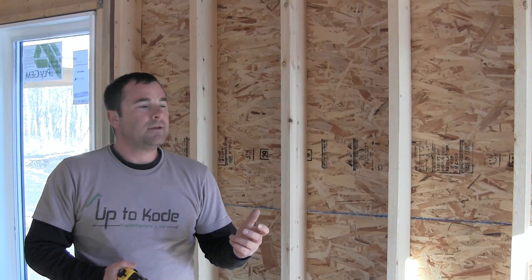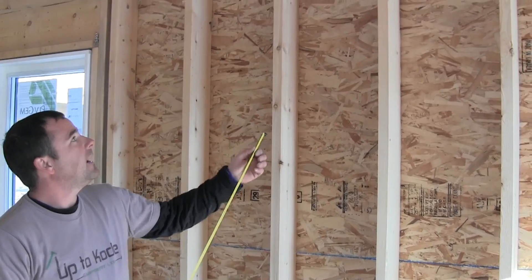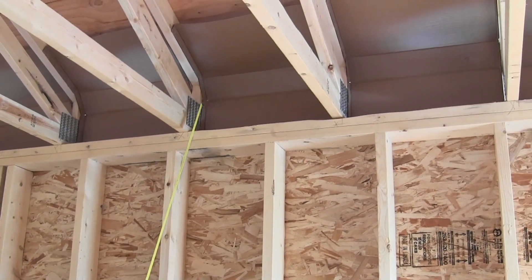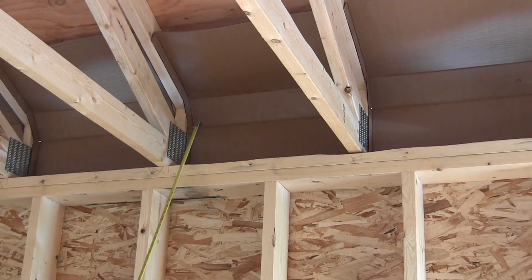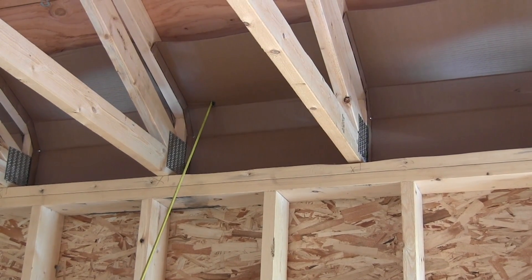Here's a high efficiency tip. We're going to talk about roof trusses. Typically when you order your trusses, you have about a four inch heel. What that means is you have four inches from the top of your wall to the underside of your roof sheeting. Once you allow some air space in between your insulation stop, that's even less than four — probably three.